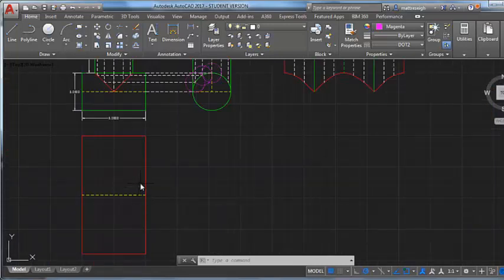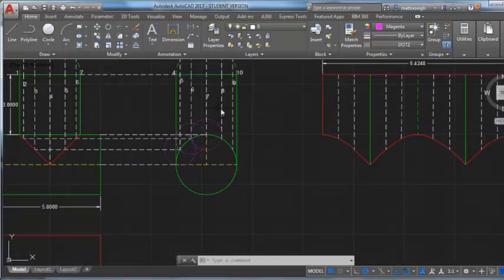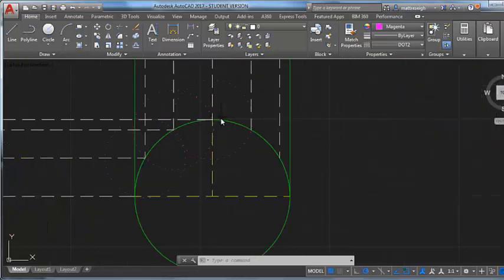And that will change if the diameter changes. I guess that's where I'm almost questioning myself. But if this diameter is smaller than the bottom header, if I have a branch and header of different sizes, then these spacings change. And I have to show that change down there when I make this header. But for this actual part, all I need is stepping off where that branch is. So it's kind of like 6 spacings of like there to there to there would be the center, and then back this way.